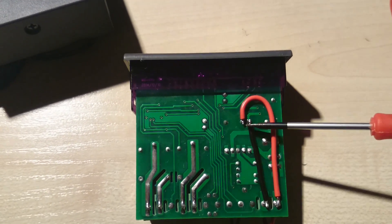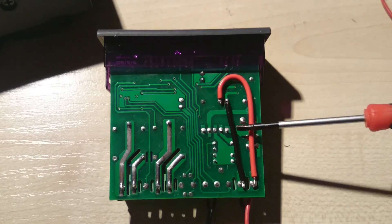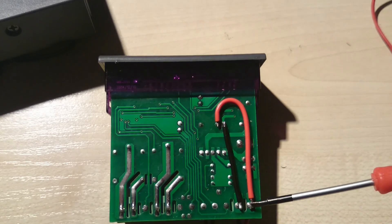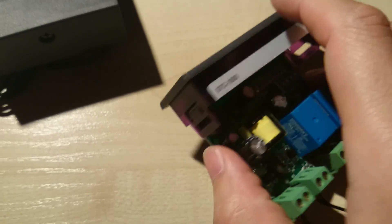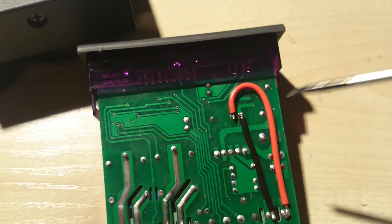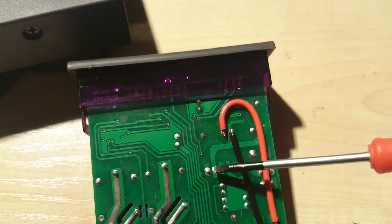There's a gap right here — on the right side is the negative pin, you have to connect this to here. On the other side is the positive pin and you have to connect it here. You have to connect it this way; if you connect the other way it doesn't work because of this diode over here. I'm going to show it one more time. These are the three pins — this one, this one, this one — from the transformer, same as these ones here.